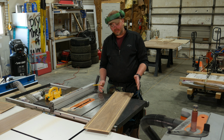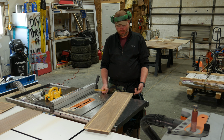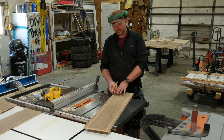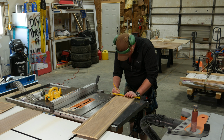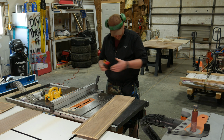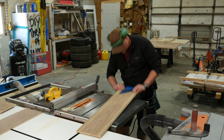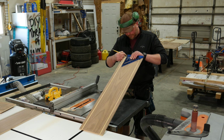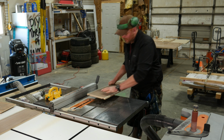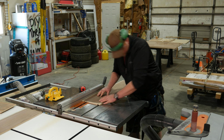Okay, so the next set of dado grooves, on the inside of the wider dado grooves here, are going to be set in 1/2 of an inch farther in. Mark 1/2 inch in there. Grab a speed square so I can wrap that mark around the side. Take this, butt it up against the fence.